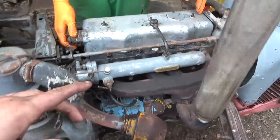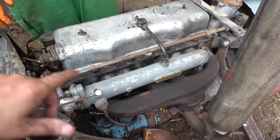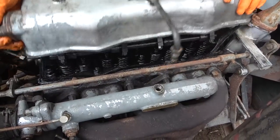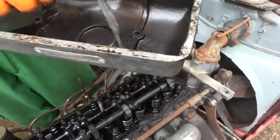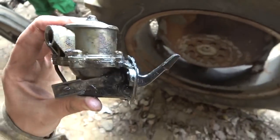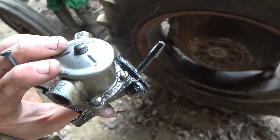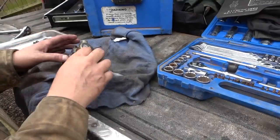Now the last time we had the tank off when we swirled the tank out, we noticed there was a leak on the rocker cover, so we've got a gasket this time. We're going to get this off and have a look inside for the first time — see what it's like. Yeah, the gasket is all broken up, loads of life in that — a bit of sealant in that would be lovely. So the lift pump is off. I'm going to strip it out now and use the rebuild kit to rebuild it. I don't think it's doing much of a job — might have a pin prick in the diaphragm or something like that, because I think that's leading to some of the running issues with this tractor.